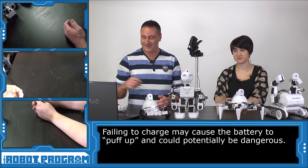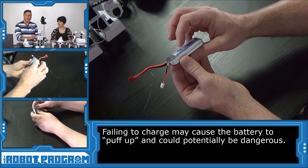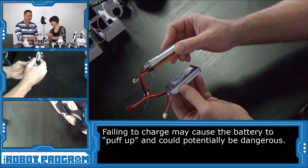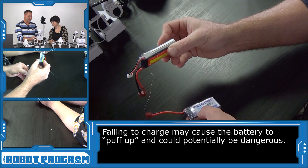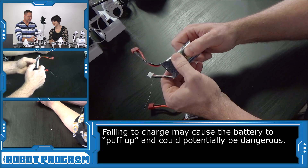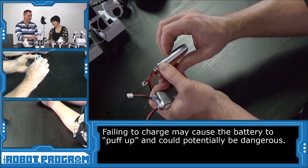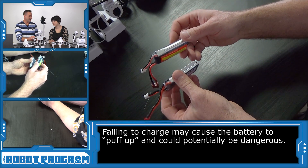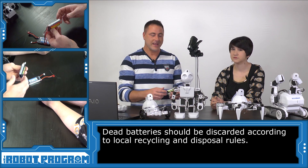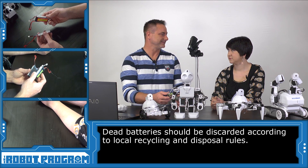If you don't pay attention to the battery monitor, the battery can actually get damaged — they can experience something called the puffy syndrome. The puffy syndrome is when a lithium polymer battery's internal gases expand, causing the battery to puff up. This is a battery that has been very abused — you can see the size difference, and if you push on it you can feel air trapped inside. It's because of the chemical reaction that occurs when a battery has been killed off, let to die, and then recharged and let to die again numerous times. Not very safe. If you ever see a battery that has gone puffy, you have to dispose of it — bring it to a recycling facility.